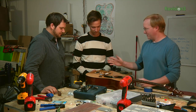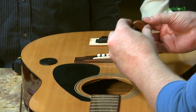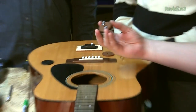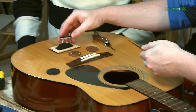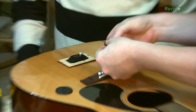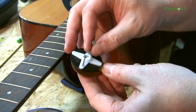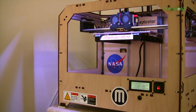Before you got here this morning, we put the servo into the guitar, and I have this piece that attaches to the servo — I've made a receiving plate for it. It bolts from the servo up to this plate, and these set screws will hold the rod. You need to be able to access that to set the set screw on the servo, and then you can use the set screws to further tighten the rod — stiff and adjustable. The 3D printer is making the pick end now. After that, the next step would be the lift arm.